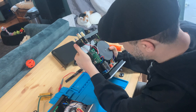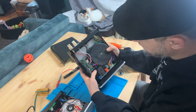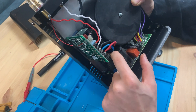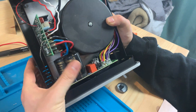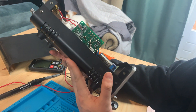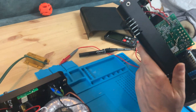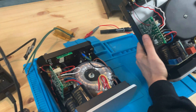The other thing I do when I'm in here is look around to make sure all the capacitors are in good condition — checking that there's no electrolyte leakage. If you do see electrolyte it will usually show up on top. These are a little puffy but I don't think there are any problems. It looks like this one is a 10,000µF, plus or minus 20%, capacitor — probably aluminum electrolytic — and there are two of them.